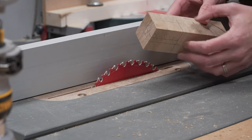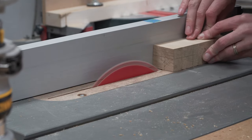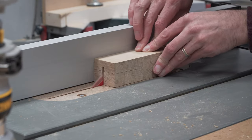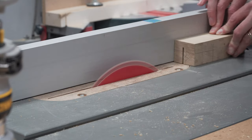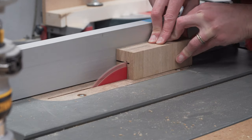We then cut a little cube from an offcut of wood we had. This will be glued to the main block to support some of the larger knives. We were careful with the grain direction here so that when it's all glued up, this little block and the main knife block will match up nicely.